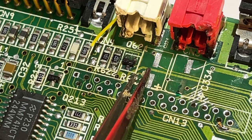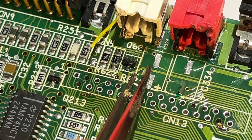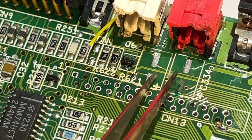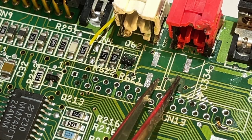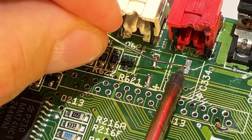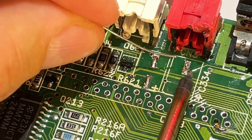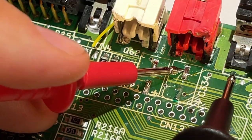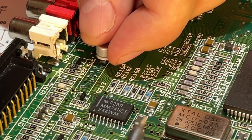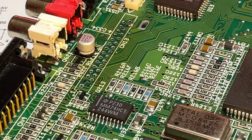It simply doesn't seem like this hole is able to take any solder, and it just couldn't handle any heat as well. So need to do something else. I'm gonna solder in the caps, and then I can solder a wire from here to the chip. And this one needs a bodge over to the neighboring trace, but maybe if I just drag some solder over there. But at least it is connected now. Okay, I'm gonna solder in this now. So that side's okay.